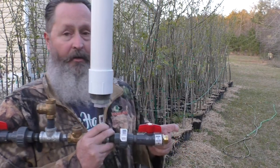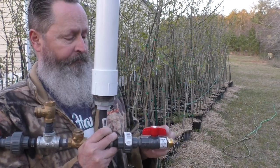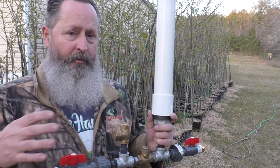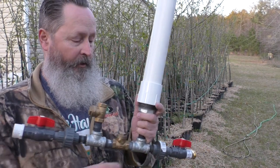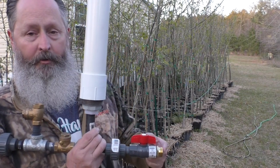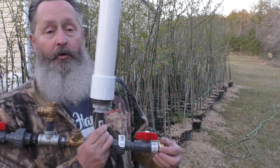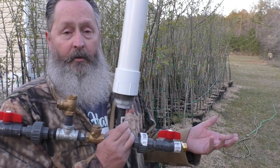And the other thing, I've got another piece of black pipe that I'm going to put on here that's 2 feet long. And if you have very flexible hose, the water ramming effect, the hammer effect, that flexible hose will absorb some of the energy, and it won't pump very efficiently. So I'm going to do a couple of experiments to see, if I put some black pipe on the end of this, would 2 feet be enough to not lose so much hammer? Does it need to be longer? Do I even need it at all? Will it still work without the extra cost of that?